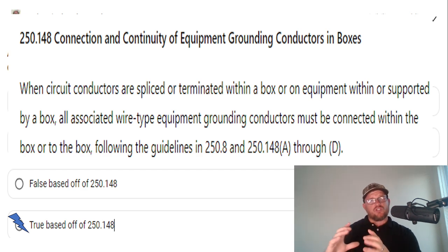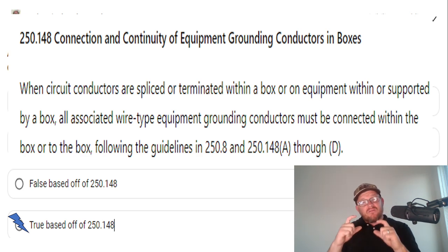So in our scenario of the four-gang switch box, I should have bonded all of those grounds together and then made my appropriate pigtails jumping off and going to each device as necessary. I think this is a big one that gets missed all the time, and hopefully this brought some clarification. There are some other rules in 250.148 that I highly recommend checking out — it's like a 30-second read, but there's a lot of meat there.